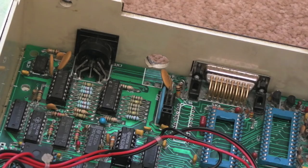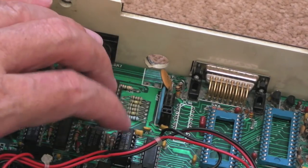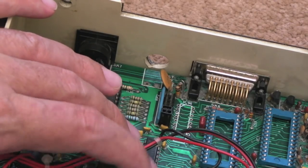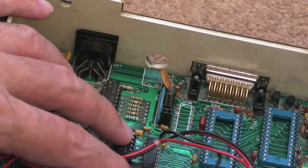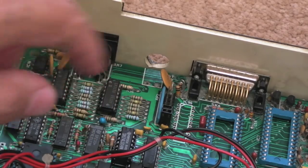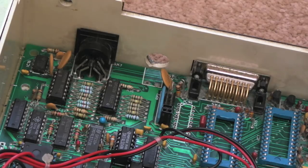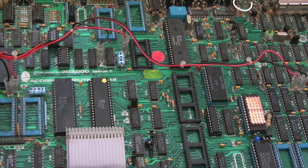Doing a capture with no ROM, RAM isolated via IC14 removal — I can see B5, BD, FF cycling. That 74HC32 was weak: when it warmed up, you'd lose the clock. And the 74LS04 was generating resets at very high frequency — the logic probe just showed high, indicating it came out of reset. But the logic analyzer was picking up those reset pulses very frequently. A very good job I got the logic analyzer on there — I would have been totally in the dark without it.